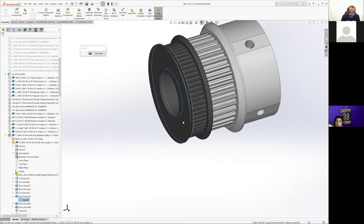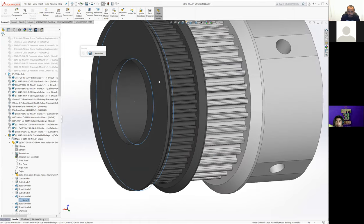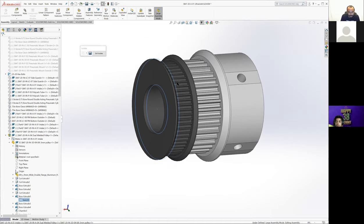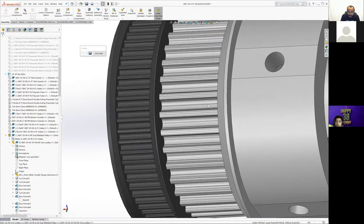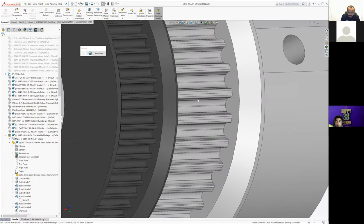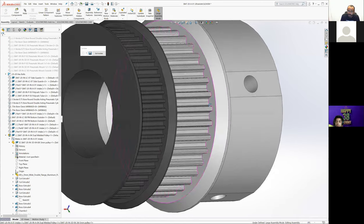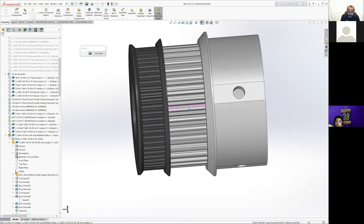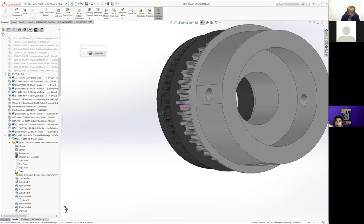So this would have been some sketch that we pushed back in and refilled in some areas that on a molded pulley, like what Vex sells, would be hollow to save weight on an aluminum one. But since we're plastic, we don't care if it's hollow because that's all set by the 3D printed infill settings. So a lot of them are just modified vendor pulley models, and those work totally fine for us. The teeth geometry is almost certainly not perfect, but for things like intake, where we're not really worried about the torque rating of our belts and are more worried about just making sure we can transfer the power over, they work perfectly well.